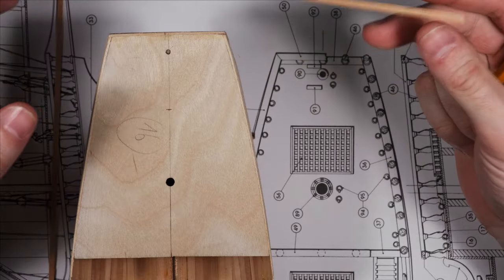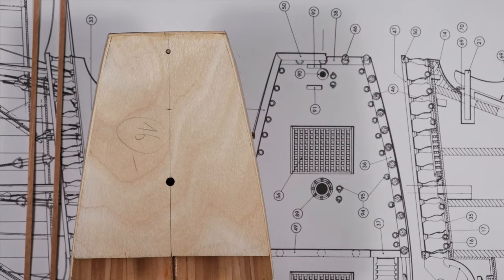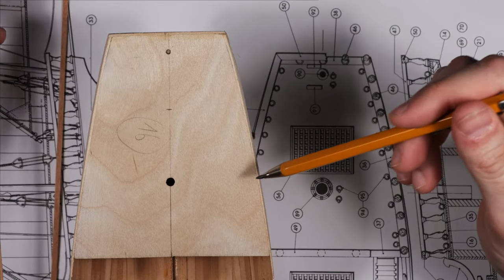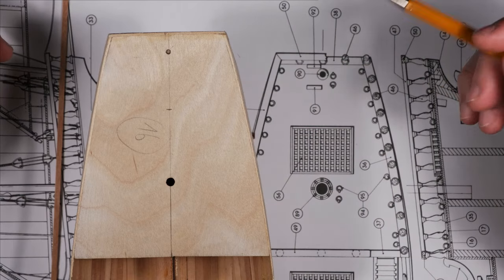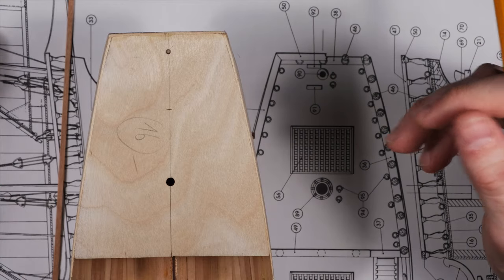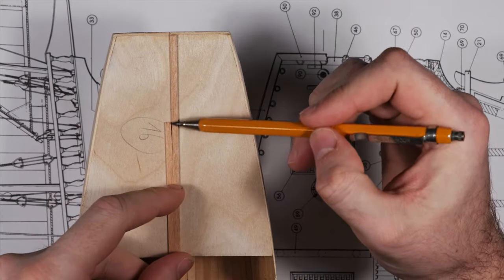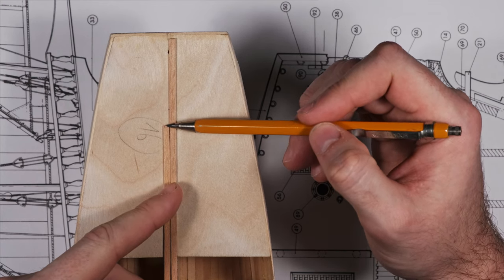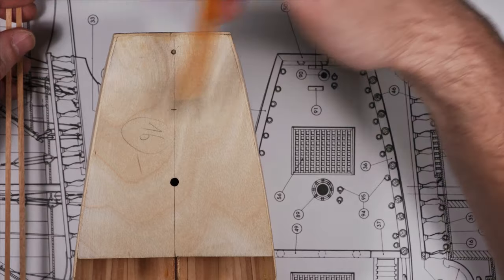So usually the length of one plank was between 6 and 8 meters based on one source which I found, or 6, 9, or 12 feet. I decided to use about 6 meters. In this scale it's 92 millimeters, but I will round it up to 100 millimeters. Again, in the three plank scheme this length is, I think, 1/3 of plank length, but also it should be nailed to rib bands.